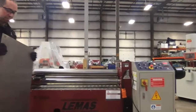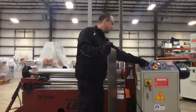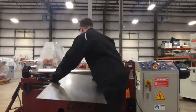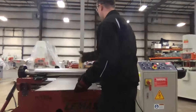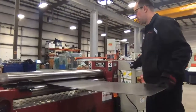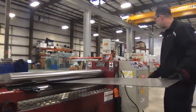When rolling on the three-roll, the first thing we're going to do is raise up our bending roll. We use a straight edge for squaring up the material. Since the rolls are crowned, we always feed the material in and center it to the roll. Because I have my pinch gauge here, it's already been set up for this material.